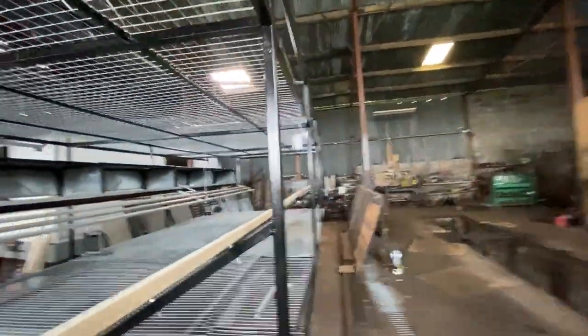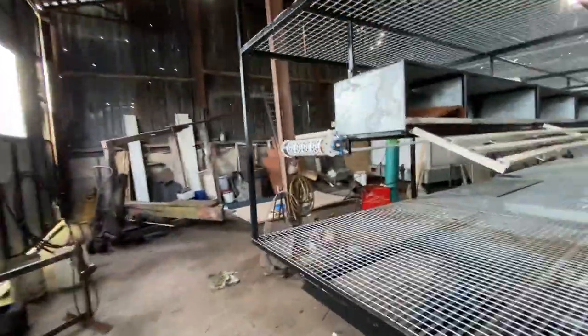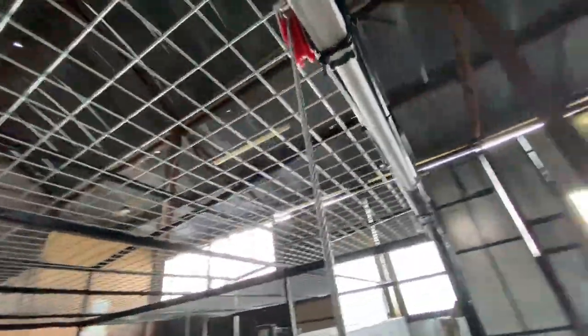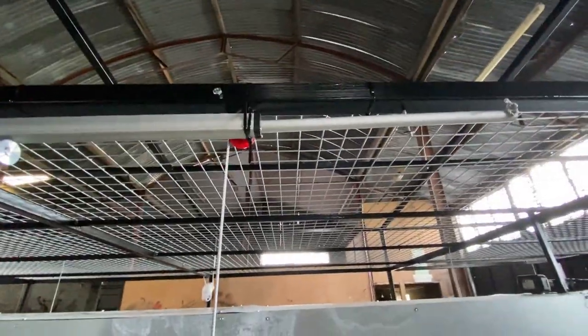You can see I've got my camera in. I'm just kind of wiring it up now. I've got the door on the far side done. If I go around and show you, it's very simple. The wire goes on here. The actuator goes up to a roller. And then when the actuator goes out, it closes the door up. When this actuator goes in, the door will go down.